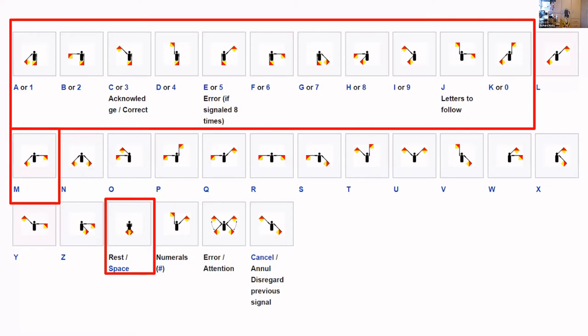These are the semaphore letters I've coded into the program, and the ones in red are the ones I use regularly on the clock. You can see A is 1, B is 2, C is 3, etc. The right flag starts at 30 degrees, then 45, then 135, 180, and so on. It's quite obvious you can just use a couple of 180-degree servos. There are a few letters that use more than 180 degrees, so O, W, Z are letters I can't actually do.